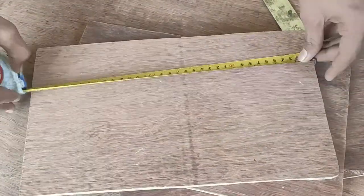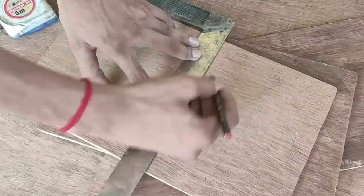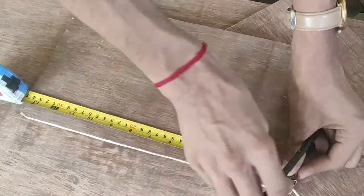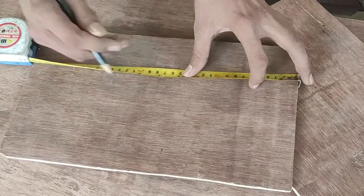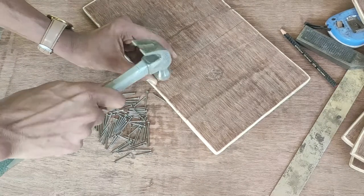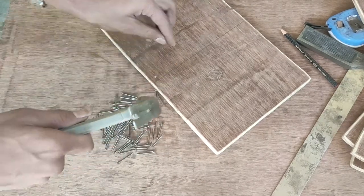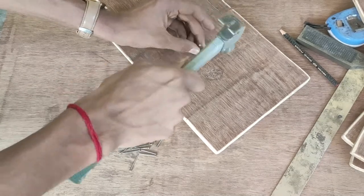After I had my parts laid out, I measured 15 cm on the branch pieces and marked a line. This is where another branch piece will get attached, and that crisscross pattern will form. It is marked in the middle of the branch piece, where another branch connects. After marking the line, I used a small nail and drove it all the way through the plywood piece on the marked line.